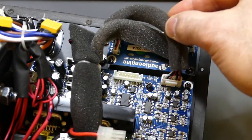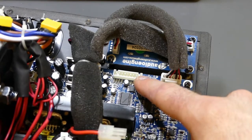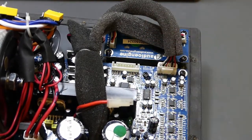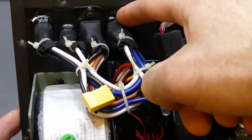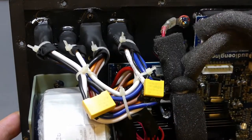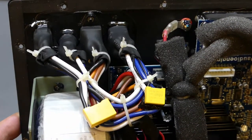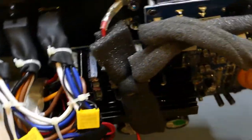Overall very nicely done — they took care to put foam on all the wires so they don't vibrate and ultimately short out. There's one connector for power and one for signals, which I believe is the front panel connector. I'm not exactly happy with them using this black sealant on components — if these ever had to be removed it would be a pain. Guys, just use a screw, a nut, a PEM fastener, or a back nut — keep it simple.